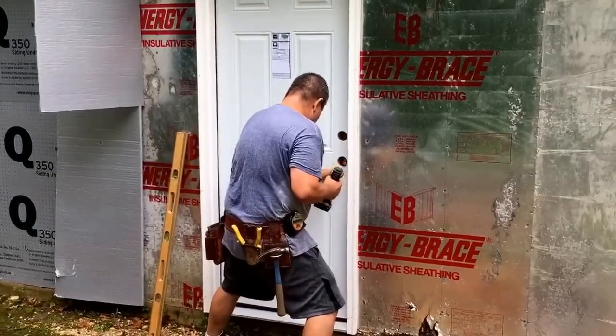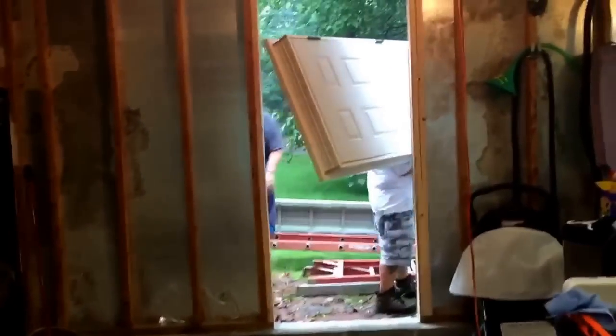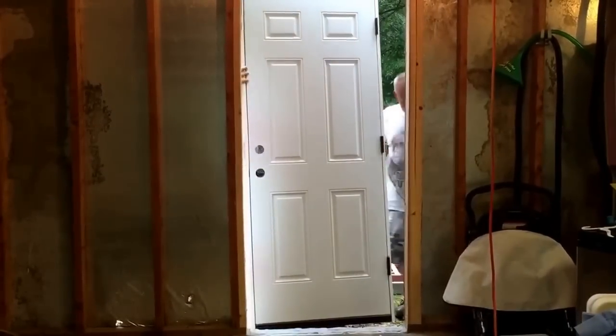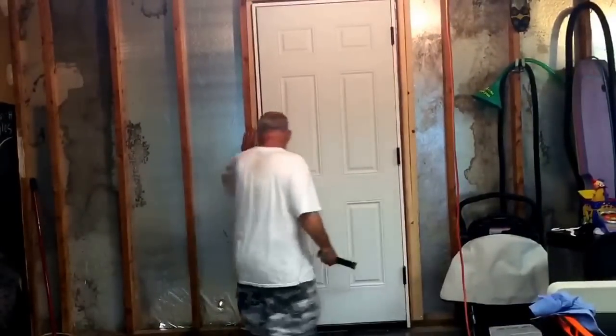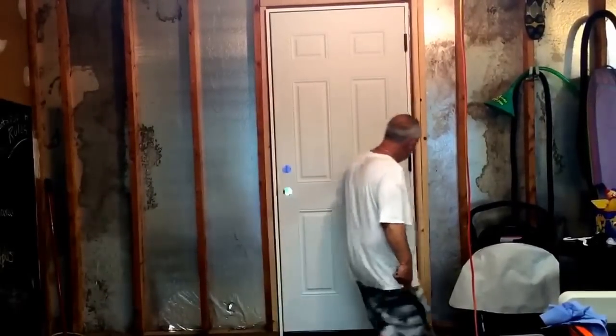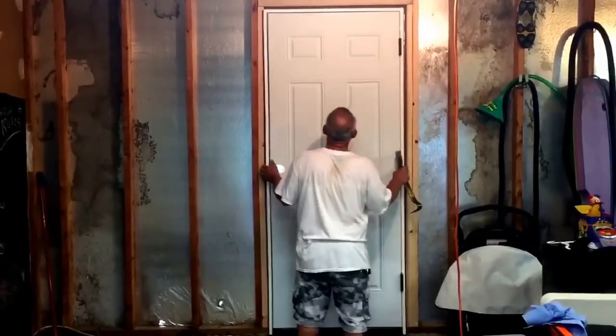Open the door up, Mark. We want the big level out here. The bottom is pretty well centered. The top needs to go over though — check for plumb first.